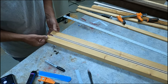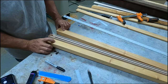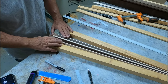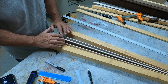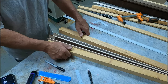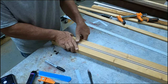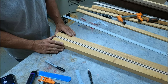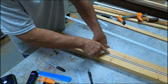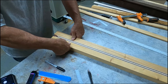I've got all of my pieces milled up for my neck. I've got my two pieces of mahogany, which will wind up being quarter-sawn. And I've got three pieces of curly maple — two eighth-inch pieces and a quarter-inch piece in the middle — and two eighth-inch pieces of wenge, however you want to say it. I think it'll make a cool neck, and it all lines up being quarter-sawn. All three of these pieces of curly maple are cut out of the same piece — I'm going to line them up so the little flames go right through when it's all said and done, at least I hope. That's the plan.